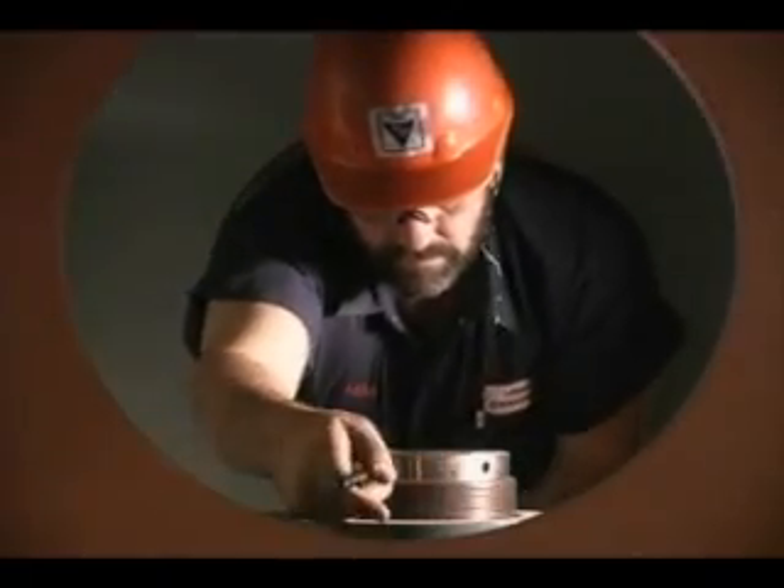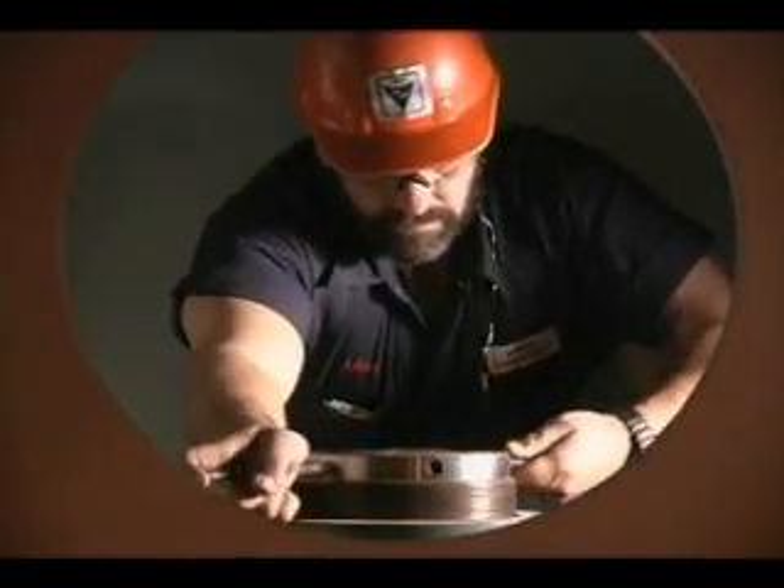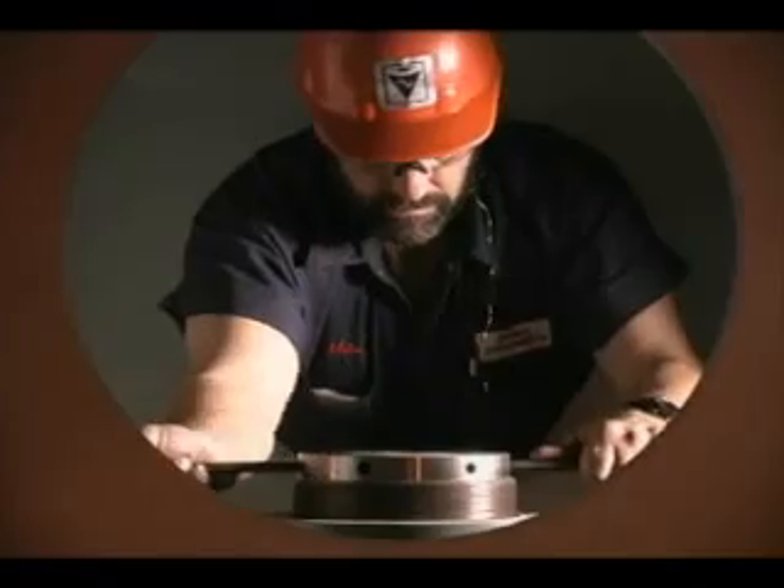It's amazing how it'll raise it. They know exactly how many threads per inch will give them how many thousandths — like a half turn, a quarter turn, or one eighth turn. They'll make their adjustments, set it back down, and level it, and they're just about right on every time. That's always a possibility that when you're jacking a press to level it, it gets offline and off center. With the Vibro system, you're able to control that very well individually with each mount and just adjust each corner as needed without throwing the press a sixteenth or an eighth or sixty thousandths one way or the other.